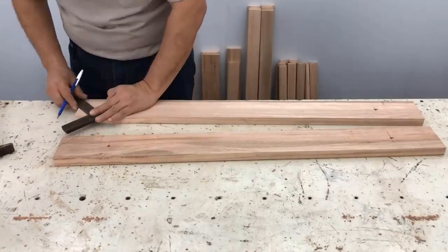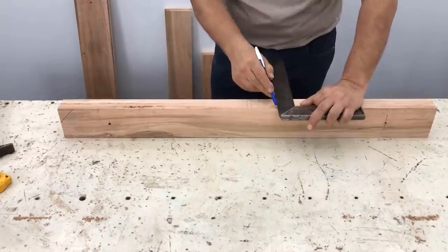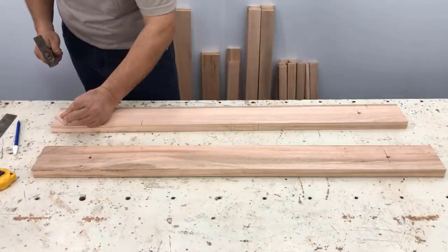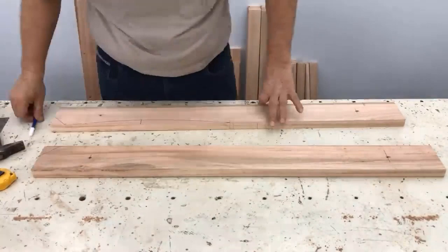We begin to mark — we leave it even and mark it at 5 centimeters, then mark it with the square at 45 degrees. We mark it at 48, 49, and 6.5 centimeters, then mark half of 48 which is 24, at 2 centimeters. We nail it at 4 millimeters on both sides, put the flexible ruler, and mark the curve of the seat.